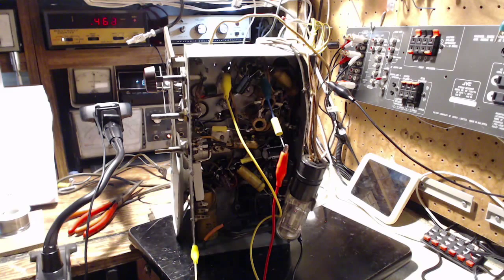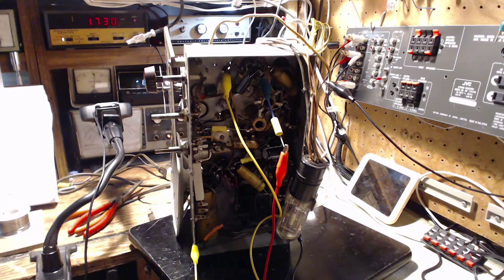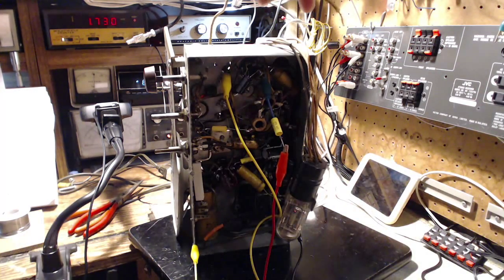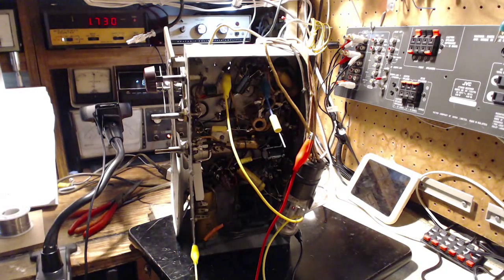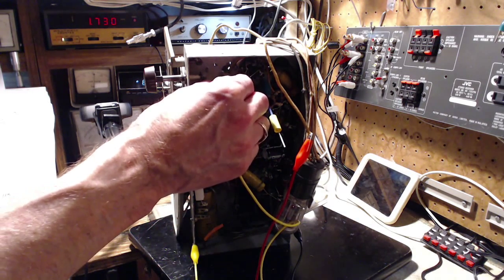connect signal generator output to antenna and ground, dial up 1730. So let's first dial up 1730. Okay, 1730 there. And reconnect the signal generator to antenna and ground. So, oh my gosh, I still had the radio attached to the outdoor antenna. Signal generator from there. Stick it there. Let's turn down the... Well, the output was very low on the signal generator already. I think we should remove this connection from the radio.